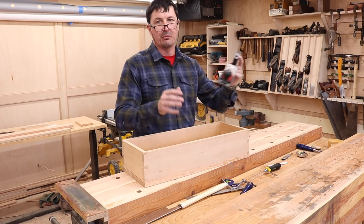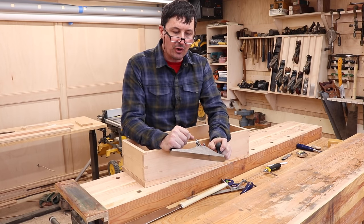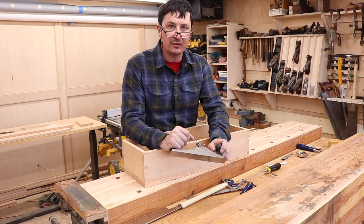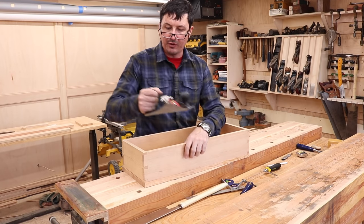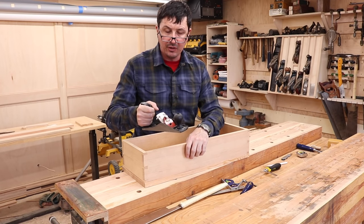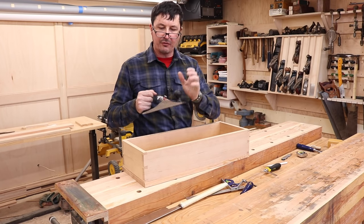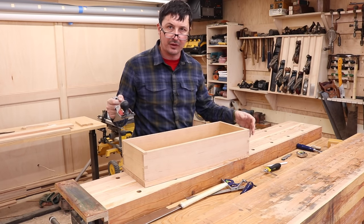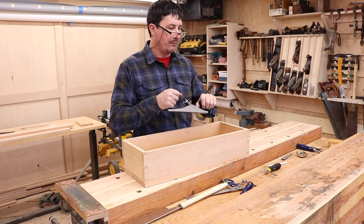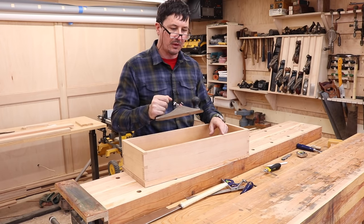So this is the twenty-dollar plane. It is sufficient, but you've got to keep it sharp. Where it really falls down is if you try to take a lot of wood — it just doesn't have a thick enough blade and it chatters. And if you want to plane end grain, it's not advisable — it just doesn't have the rigidity. But for just general purpose, I'm going to build this box with it and I've done everything so far with it. We'll make do. That would be the first thing I'd upgrade — a nicer plane.